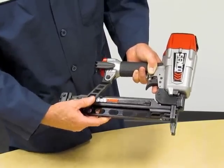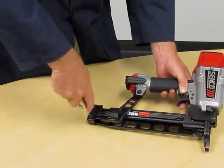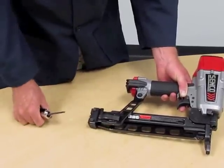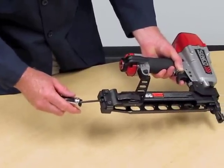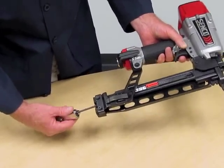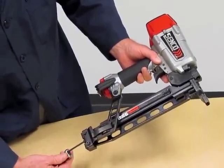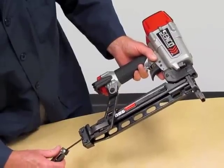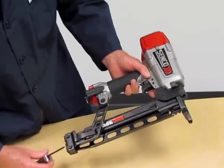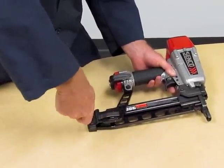So how do you tighten that? First, you take your Allen wrench and you loosen the two side screws. These are your locking screws that lock the adjustment into place. Once you've done that, you go to the rear of the track — this is your adjustment screw. To tighten, you're going to turn that counterclockwise. I'm going to lean the tool so that gravity pulls the track back, and I'm going to turn that screw counterclockwise watching the gap close at the front of the track. Once that gap closes fully, I'm going to give that screw another eighth of an inch turn and then tighten my locking screws on the side. And that's going to lock the adjustment in place.